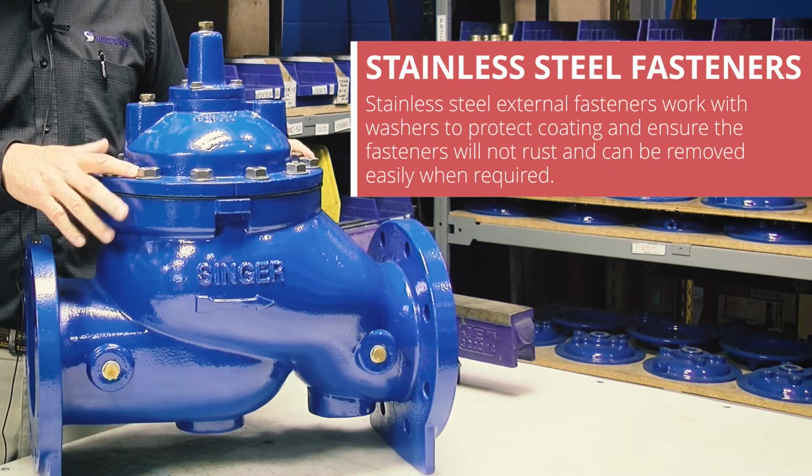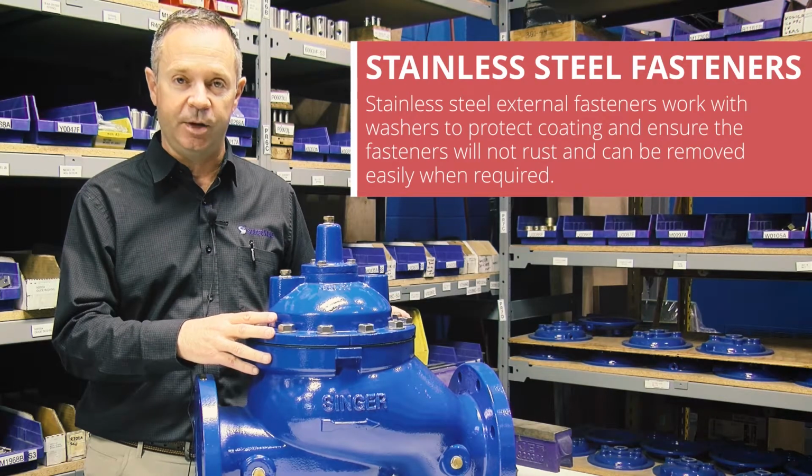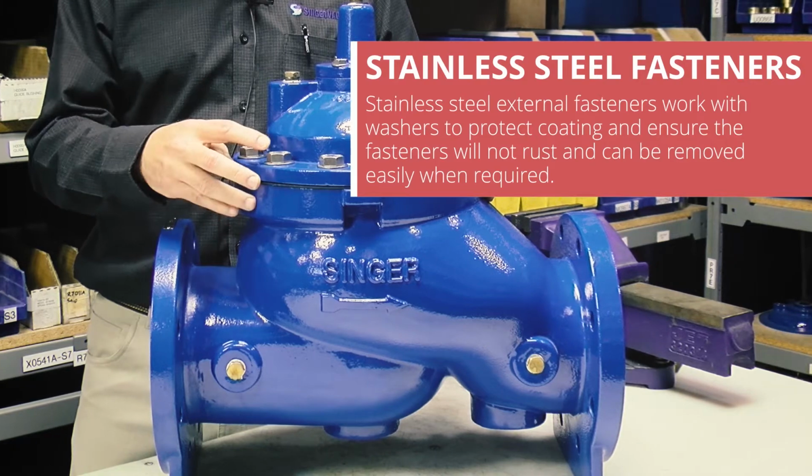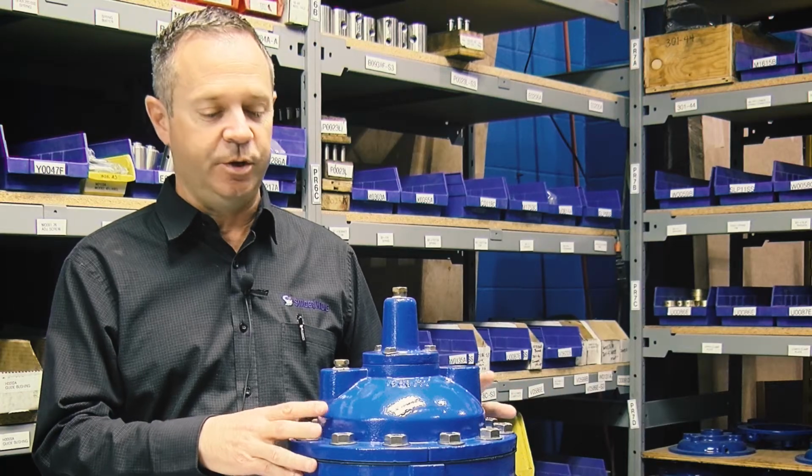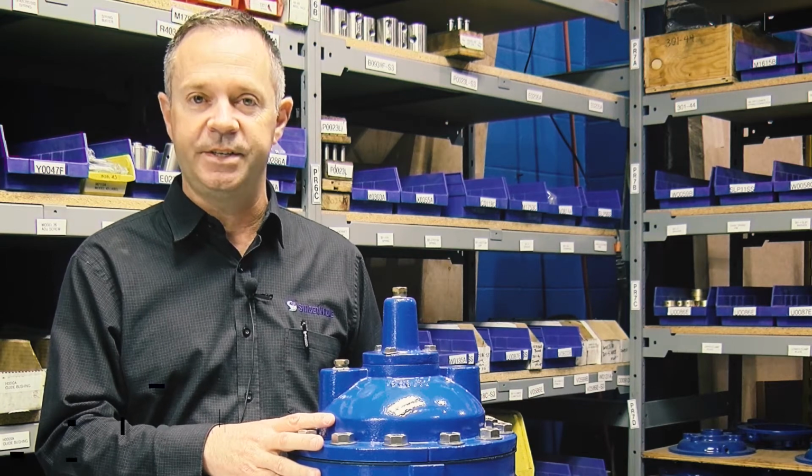The reason we use washers is it protects the epoxy coating from getting chipped off. By using the stainless steel, we have no issues with corrosion, which will allow us a long time in the future to be able to take this valve apart for proper servicing.